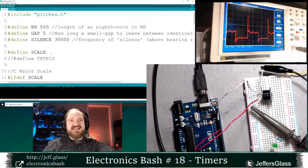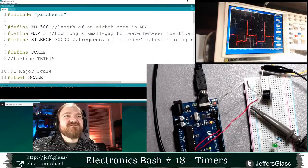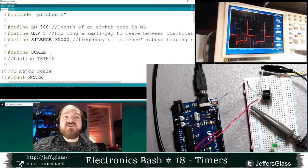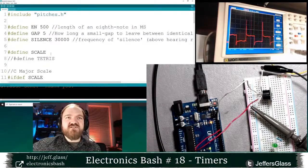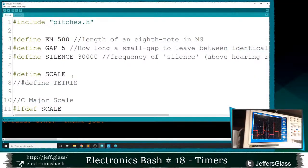Here's our oscilloscope again. And you can see as those tones change, the square wave gets shorter and shorter. Right? Because that's what it means for a tone to get higher in pitch: the frequency of that pitch increases, so the period of each of those waves decreases. So real quick, for those who are curious,